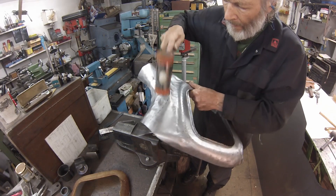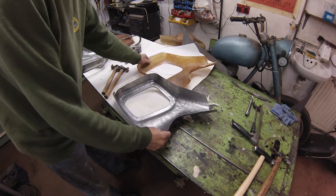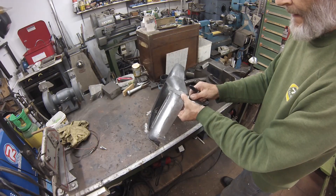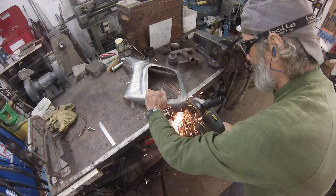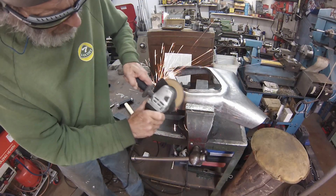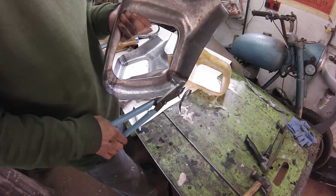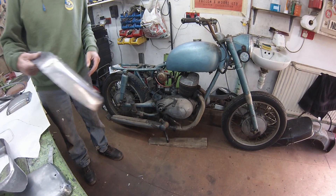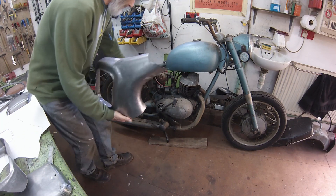Outlined here are some of the basic moves to make a pair of side panels in 20 gauge — that's 0.9mm cold rolled mild steel. This is plasma cut, cropped, stretched, shrunk, ground and welded using plastic and steel-faced hammers, a hollow log, a sandbag and an English wheel for smoothing, with both tungsten arc (TIG) and wire or MIG to weld the sections and patch up inevitable blunders.